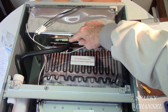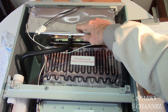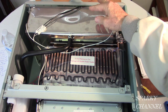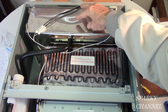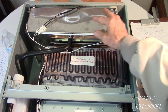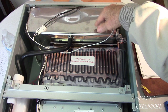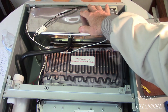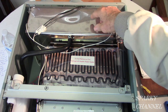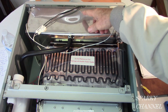And you see, you have a condensing tube coming out of the secondary heat exchanger. This condensing tube collects water. In a typical hot water heater, the gases that escape are about 300 degrees. Gases that escape from this unit are going to be somewhere in the neighborhood between 100 and 150 degrees, much lower. I've heard 100, I've heard 125 degrees. Anyway, the gases are much lower. I'm sure it would vary with how hot you're trying to heat your water and so forth. But the gases are around two or three times lower in temperature.